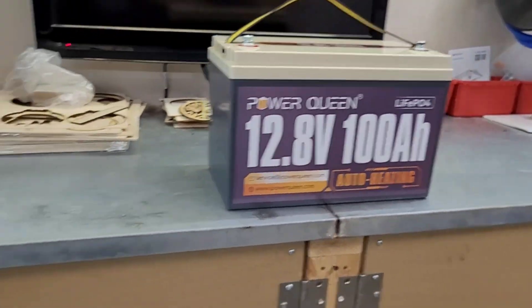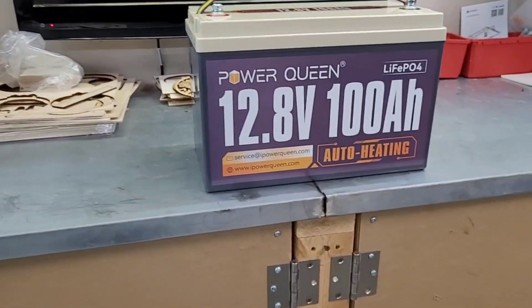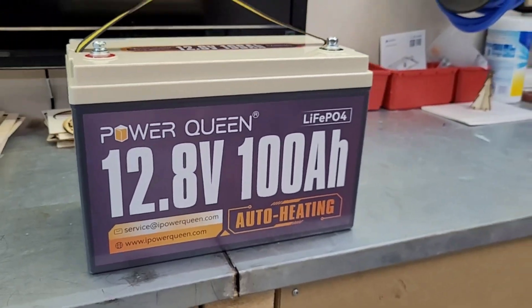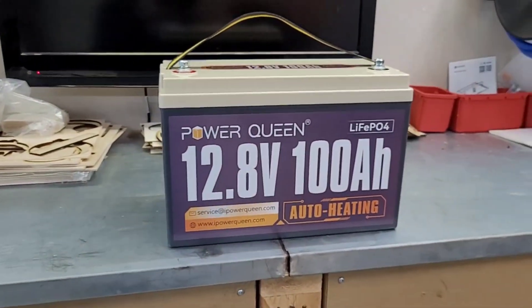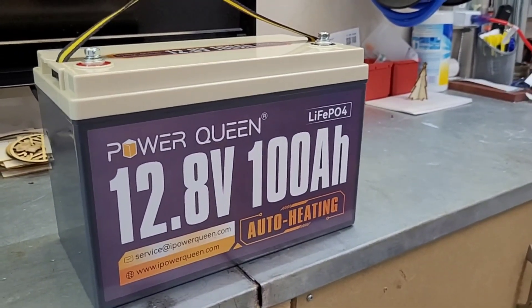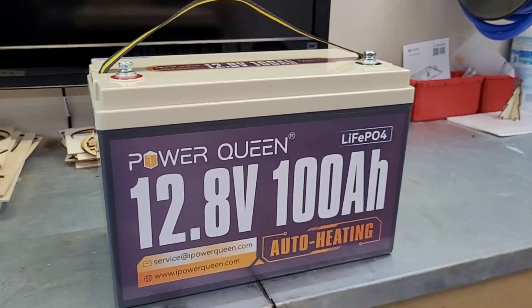We're going to test that. It's below freezing today, but I might still stick it in the little mini freezer here to get it cooled off faster, because these batteries do take a long time to get down to temperature. I put this in the freezer at about minus 15 for 24 hours and it still charged because the internal temperature wasn't quite there. About 12 hours later it did lock itself out on low temp, so we'll get it nice and frozen first.